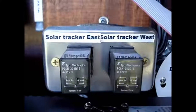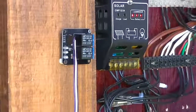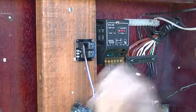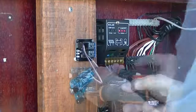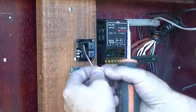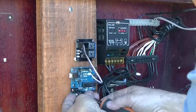I use these double pole relays, which allow me to switch the positive and negative going to the motor. Those are operated by a small two-relay card that you can get wherever you buy your Arduino — these are Arduino compatible. This is my Arduino Uno, and I mount both in my control box. I'll leave a link in the description showing how I built it. I use spacers to space them off the platform to allow air circulation so the board doesn't get too hot.